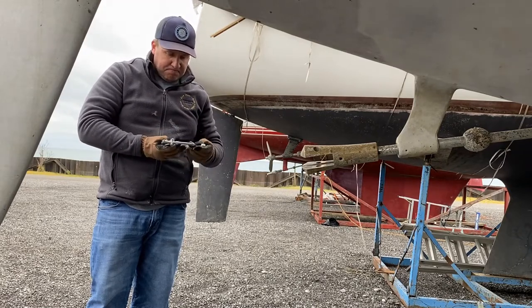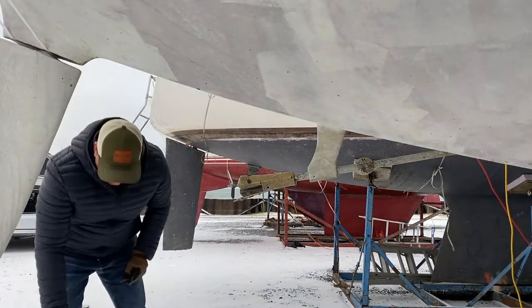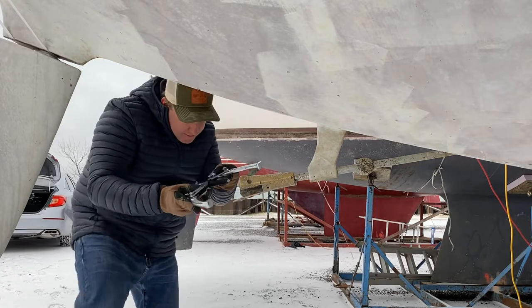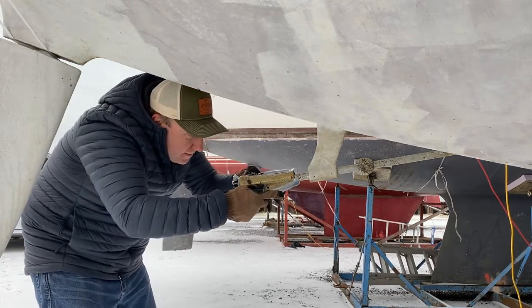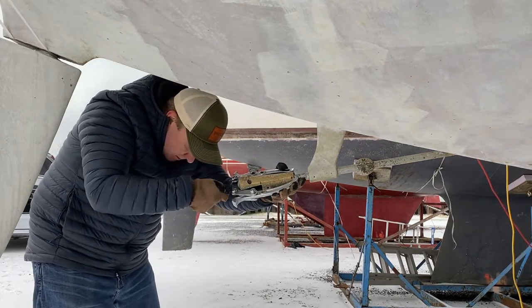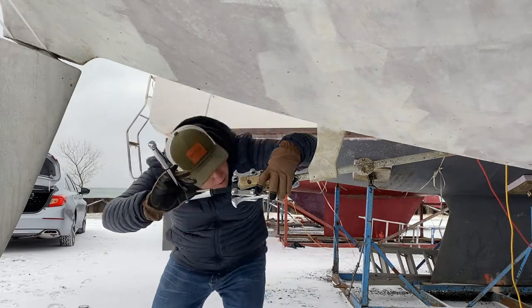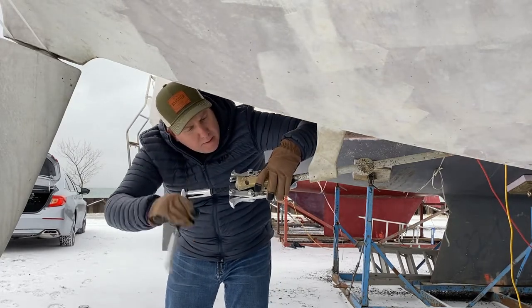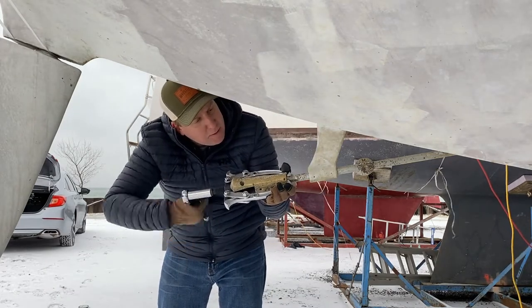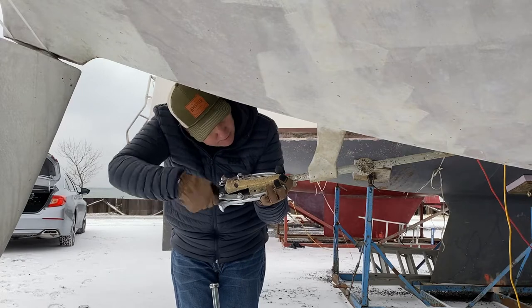Sometimes you just have to know when you're beat. Through the magic of television, here we are the next day having gone to the store and returned those puny four-inch gear pullers for these much better and more appropriate six-inch gear pullers. Since I take my prop off every season, I don't have to struggle too much. The first time you do this, if it's been a few years, you may have to apply quite a bit of force — I basically just spin it and off it comes, finishing it by hand.